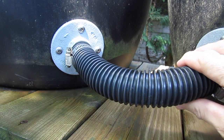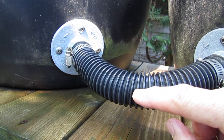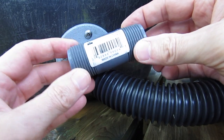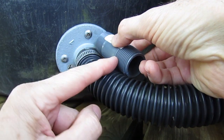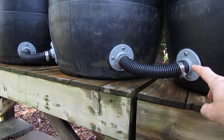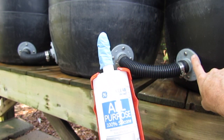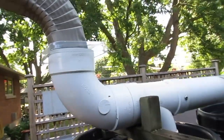This one size of stainless steel screw fits everything on the whole project. All you need to do is drill a very tiny pilot hole and use a hand screwdriver to tighten them — don't use a power drill as it may strip out the plastic. As far as the hose goes, don't spend money at the hardware store. Cruise your neighborhood on garbage day and look for anyone throwing out a vacuum cleaner, because vacuum cleaner hose is all the same size and fits perfectly with a one-inch flange. I purchased some one-inch by three-inch nipple fittings, cut them in half with a hacksaw, threaded them into the flange, slipped the hose over the unthreaded part, and used a clamp to tighten it down. For all flanges use all-purpose silicone — the cheapest stuff at Home Depot or Lowe's — put it on the surface of the flange before screwing it onto the barrel and put a little coat inside the vacuum cleaner hose, and you'll have no issues with leaks.